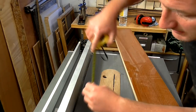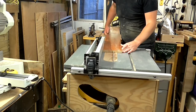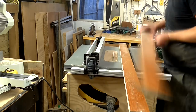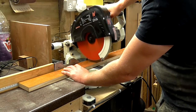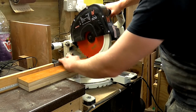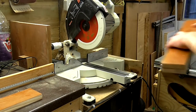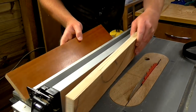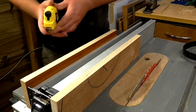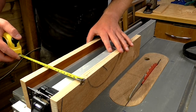The first thing I need to do is measure the height of the fence. The fence measured 80mm high, so I ripped a piece of the blockboard to 83mm as I wanted these pieces to be slightly taller than the fence. I cut two pieces to about 400mm long on the mitre saw. With these two pieces cut to slightly higher than the height of the fence, I placed them either side of the fence and measured up the total distance from one side to the other — that's 125mm.